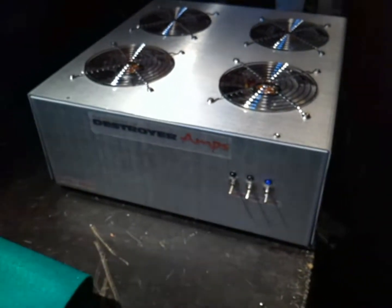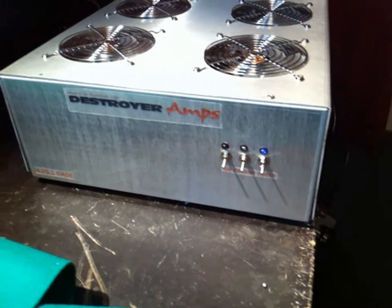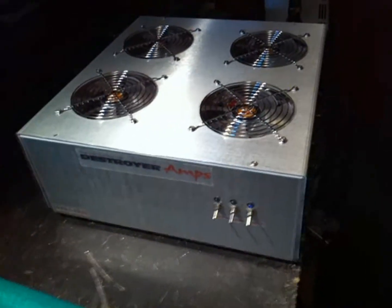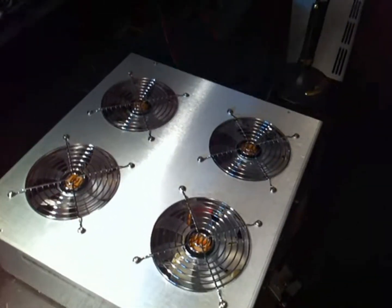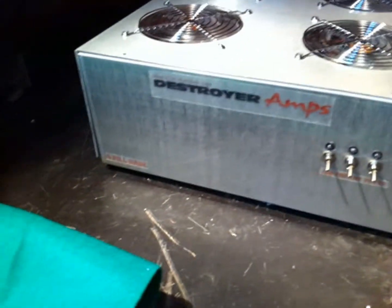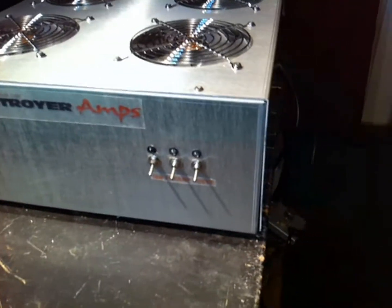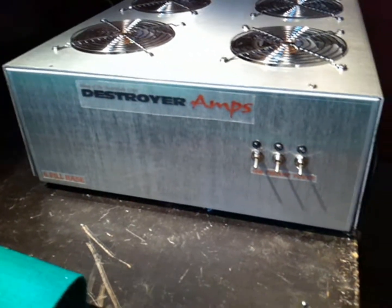This guy here is fully loaded. Comes with a sideband pre-amplifier. And this guy is also AB biased — not B biased like some amp manufacturers out there that work with 2879s. We backed this guy down to AB biasing per the customer's request. They are big on talking on sideband and definitely looking for a crisp, clear signal, and that's exactly what we are going to give them.